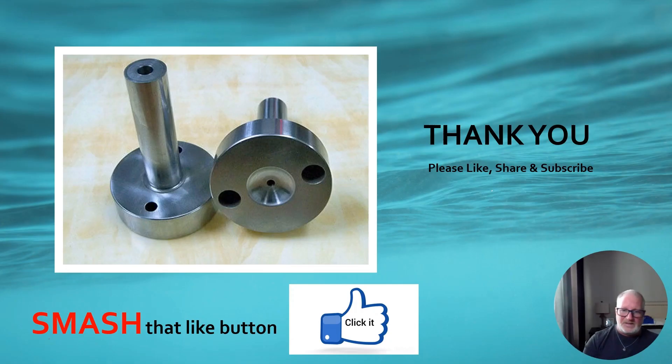Lastly, this is a sprue bushing insert. These things do go bad — the hole and the inside of the insert get damaged over time. Sometimes you can replace these inserts on the molds themselves without having to do anything else, and that's the proper fix. You can also add undercuts on the other side of the mold to help pull the sprue off to that side.